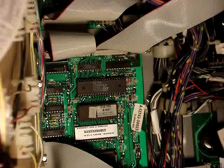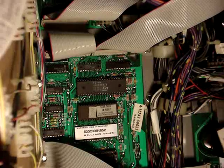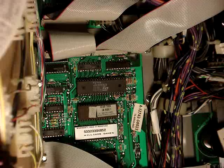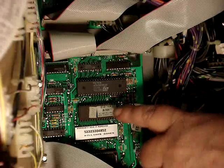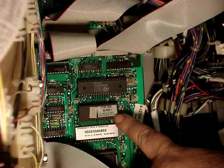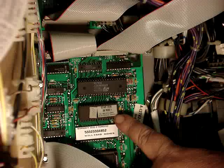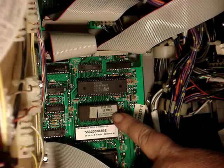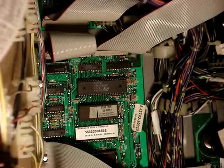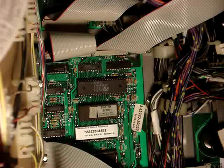For Star Trek the Next Generation, today the new color DMDs went on sale so I've ordered one. In order to install it when it comes, I need to upgrade the ROM version — I have LA5 in here now, that's the version that was in the machine when I got it. We're going to upgrade it to LX7, which is supposed to take care of some problems they had in LA5. Something I've been meaning to do for a while anyway, so this is as good a time as any. I just finished burning a new ROM for it.